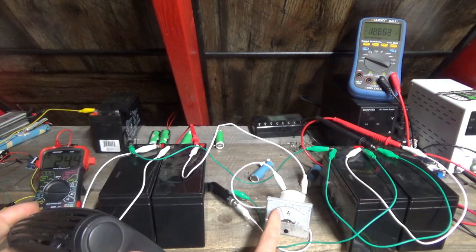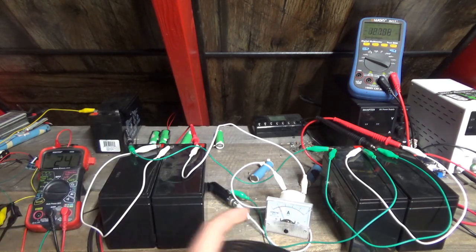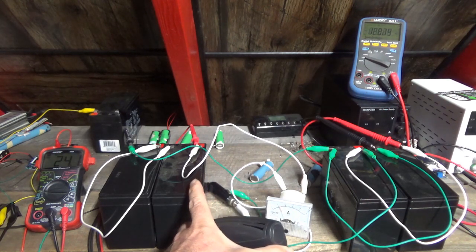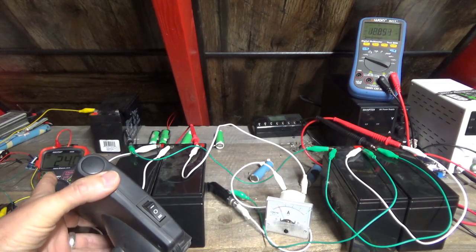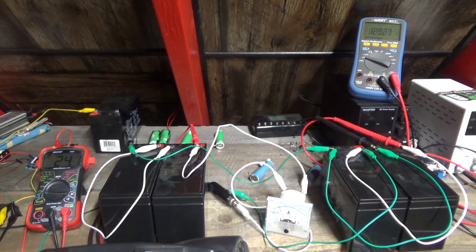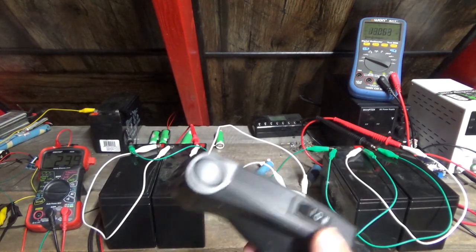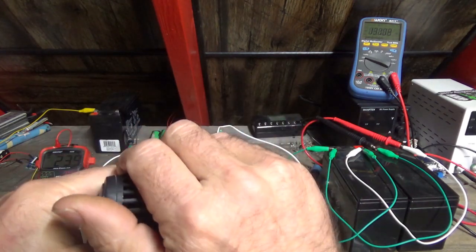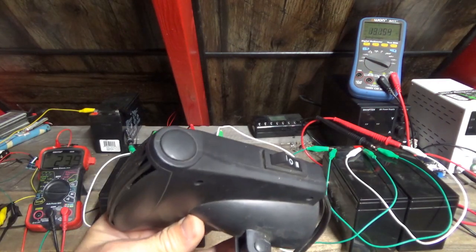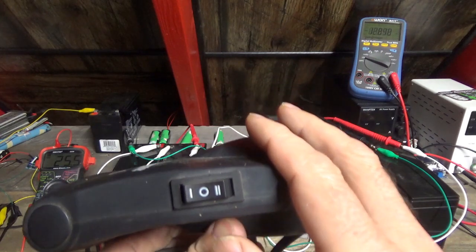It doesn't blow that hard — so we're seeing about 10 to 20 milliamps less power than without the second battery set. I probably don't have enough voltage difference between the two sets to run this on high. But I've pulled this down to 24.1 and that's up to 12.88, 12.9 volts — we've got massive transfer of power through the load. The load is running. To shut it off, the voltage jumps back up to 12.9 and then starts dropping. This is a massive demonstration of power transfer from one set of batteries, through the load, to another set.